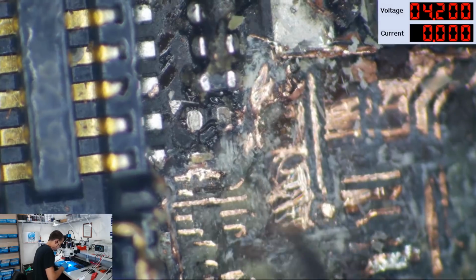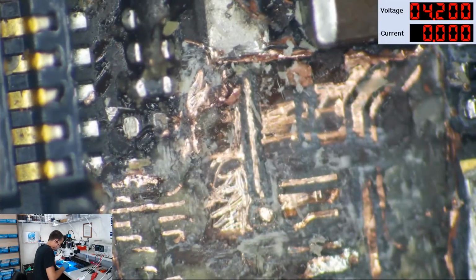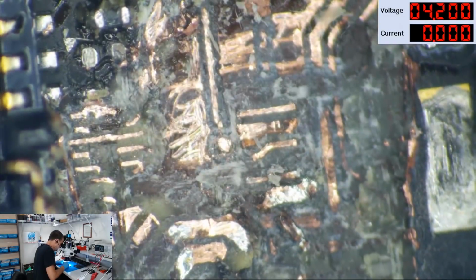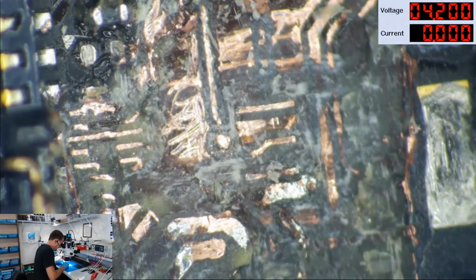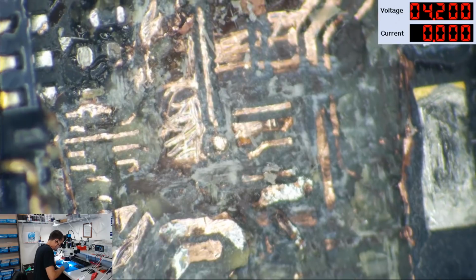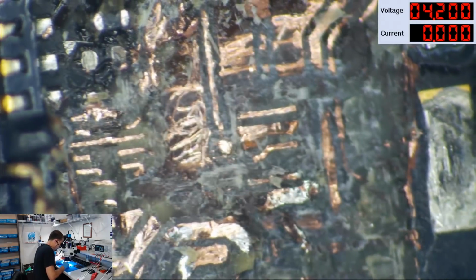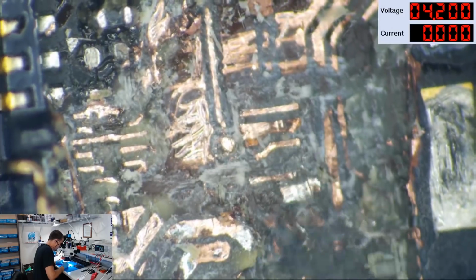They are for things like ambient light sensor, strobe, flash. We don't need that stuff. All right, so down here we do have a line that we're going to need for image. These two bottom big traces pertain to strobe and flash. We're not going to be worried about those, but we are going to need a line here for 5.7 volts. This is one of our chestnut supply lines, and it's going to run from here over to here, and hopefully this is connected down inside the PCB.